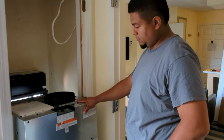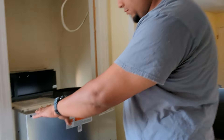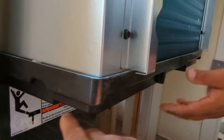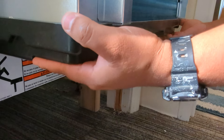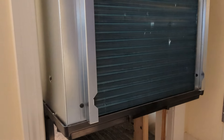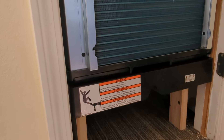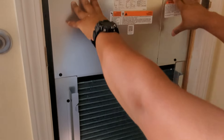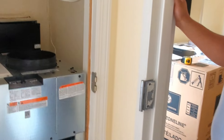So we're ready to go ahead and lock the chassis in. Let me show you — there is a little notch right here and there's a recess in that drain pan that we installed. When you push it all the way back it's going to lock it into place. Go ahead and give it a good push — push really hard. You felt it drop, right? It's locked into place and it's got a good seal with our gasket here between the chassis and the plenum, so that's going to keep the outdoor air out.